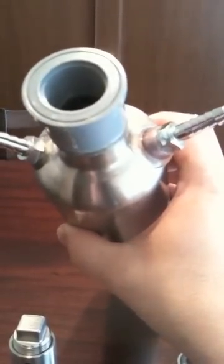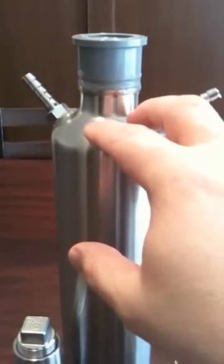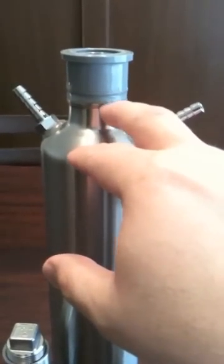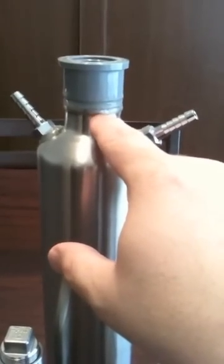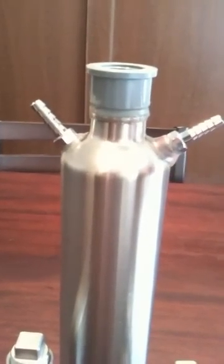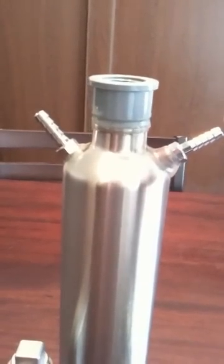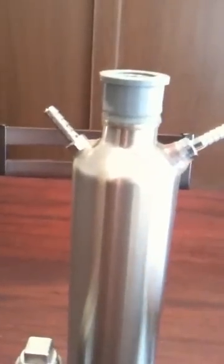What I had to do is use a plastic fitting that was threaded there to get the flash dissipator installed, but it works very well. I've epoxy-glued this fitting to the bubbler where it's actually joined — it's recessed down just below here. I've also epoxy-glued these outlet pipes. This is the inlet pipe — this is where the bubbler reservoir would be — and the gas would be coming down, bubbling down to the bottom. There's a tube that goes down from that side all the way down to the bottom.